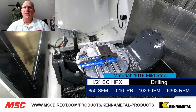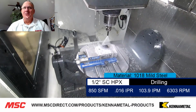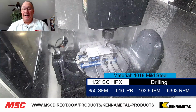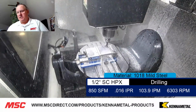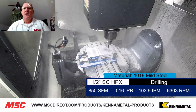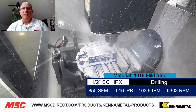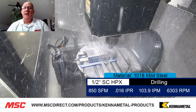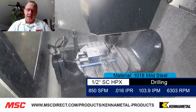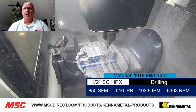It is material specific to alloy steel, and you can see here, we want to watch this because it'll go through these holes pretty quick. It is a patented drill point design, which provides excellent self-centering capabilities and reduces the thrust. So modern technology actually has patents. Like Steve had mentioned, on the Harvi I TE had 5 patents. We're still putting out patents, and we got a patent on a drill. So it does provide excellent self-centering capabilities, and again reduces the thrust.